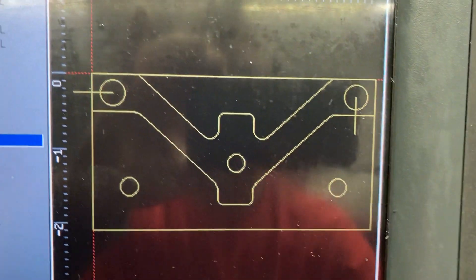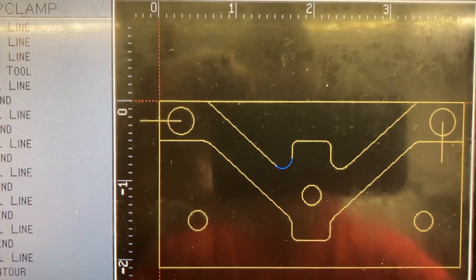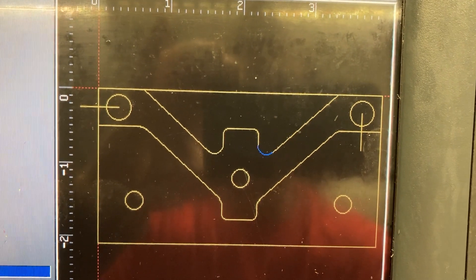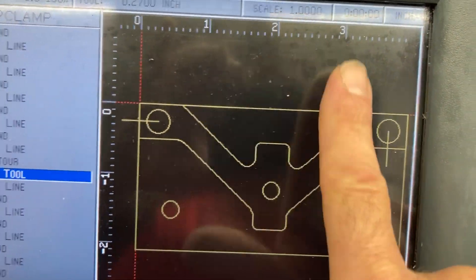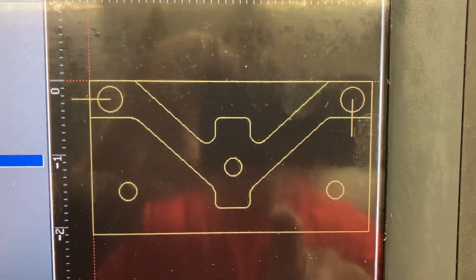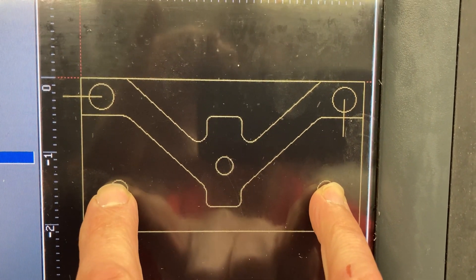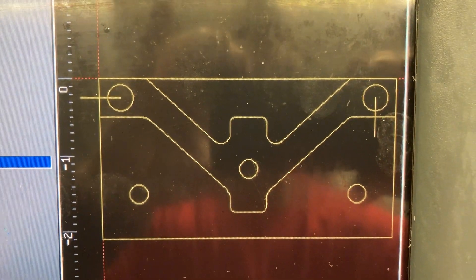When I cut all that profile right there, I don't have to worry about clamps being in the way because I have these three hold-downs. Once that section's removed, I drilled and tapped a couple holes over here so I can put two clamps on, clamp it down, and come around the other side. Because when I cut through — it's half-inch thick — once you're at 500 thou deep there's only going to be that one bolt holding this piece in place, and you can't have that. These guys are going to hold the drop from moving as we cut through it. We don't want this piece pivoting when we mill it off and there's no more material holding onto it.